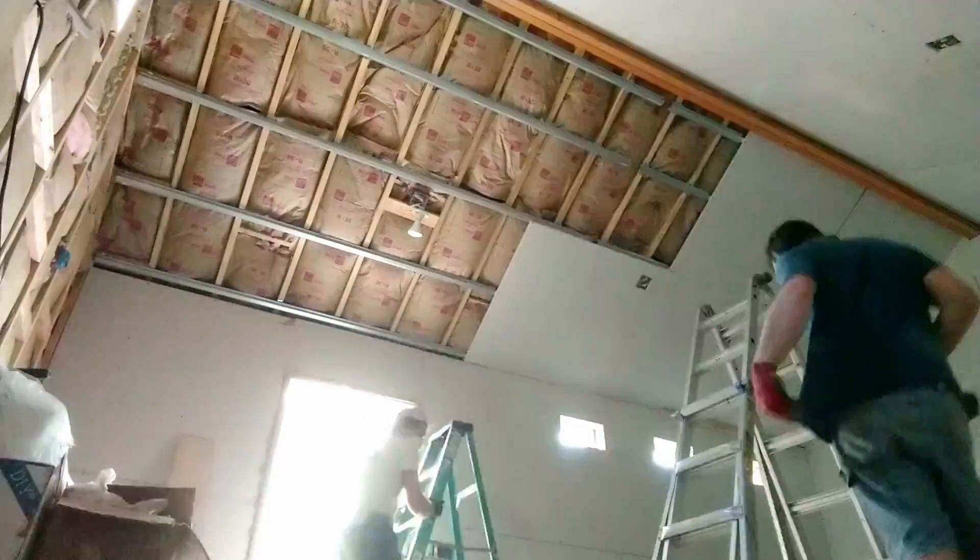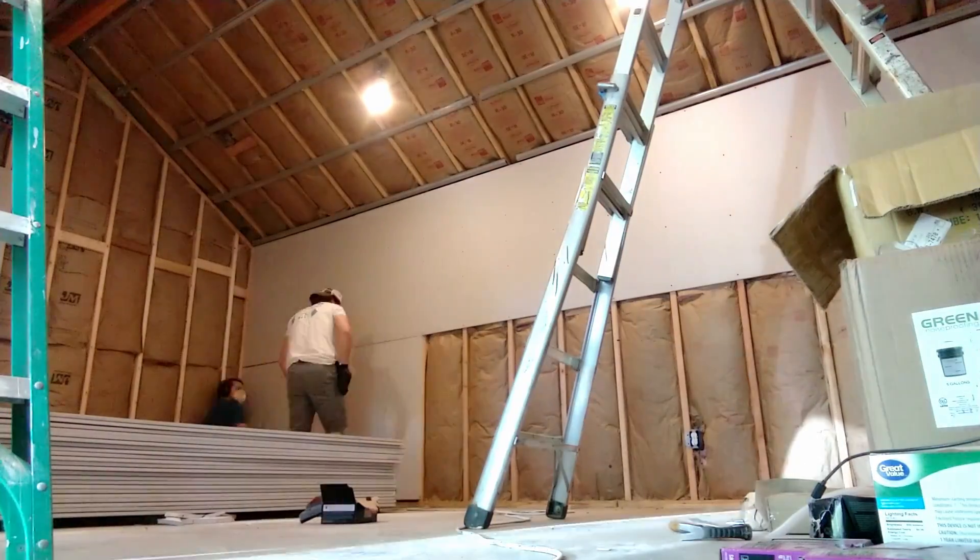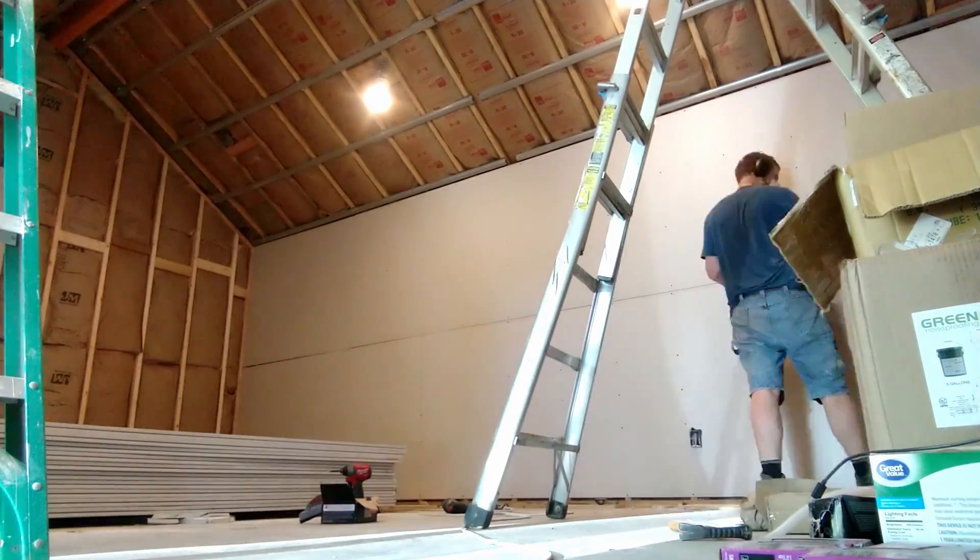The external shell is your two layers of drywall, the double wall system, and the independently framed ceiling. This system is just drywall and sound isolation — it has nothing to do with the acoustics of the room; it's all for stopping sound. On the inside of that shell, you make an inner shell and design your acoustic walls. The acoustic walls can be made of lighter timber — you don't need two-by-fours, you can use one-by-threes. You can design the shape of your acoustic design, and in that shape you can also hang your electrical boxes for outlets, light switches, and lights.